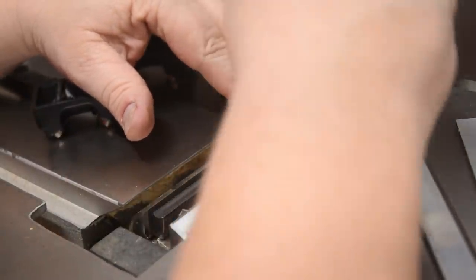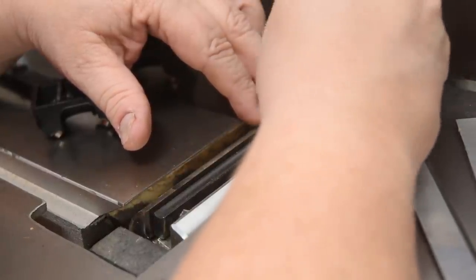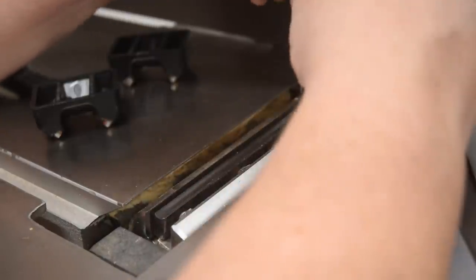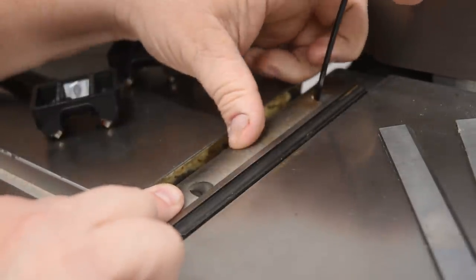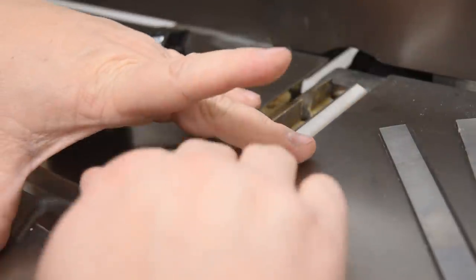Once both gizmos are in place I tighten up the two outside bolts of the blade lock bar, just snug. Then I remove the magnets — the blade is set — and tighten up the two middle ones. If you're a machinist you might expect to tighten from the middle outward like cylinder heads, but this works. When all four are tightened, I go back and raise the anchor set screws up until they bump into the blade from below to lock it in. You can check the registration by looking at the gap between the blade and the drum — it should be very even all the way across. Repeat this process for all three blades and you're set.